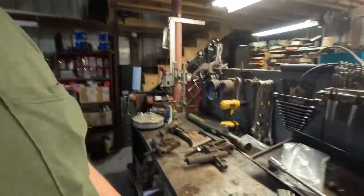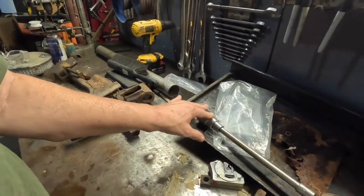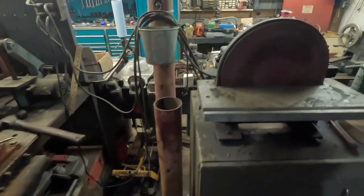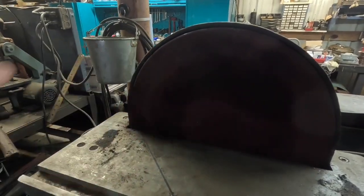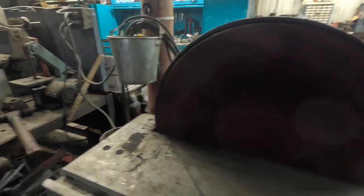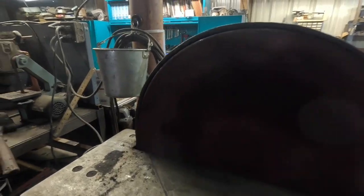But what I ended up doing, and this wasn't a bad deal either, it didn't take just a few minutes. Well, I took my cordless extension inch and a quarter socket, and I stuck that big old long bolt in there, put me a 45 degree mark right here. Is that what angle it is? Put it up against my belt and cut the angle on it. Just held it there and let it go round and around and grind that angle on there.